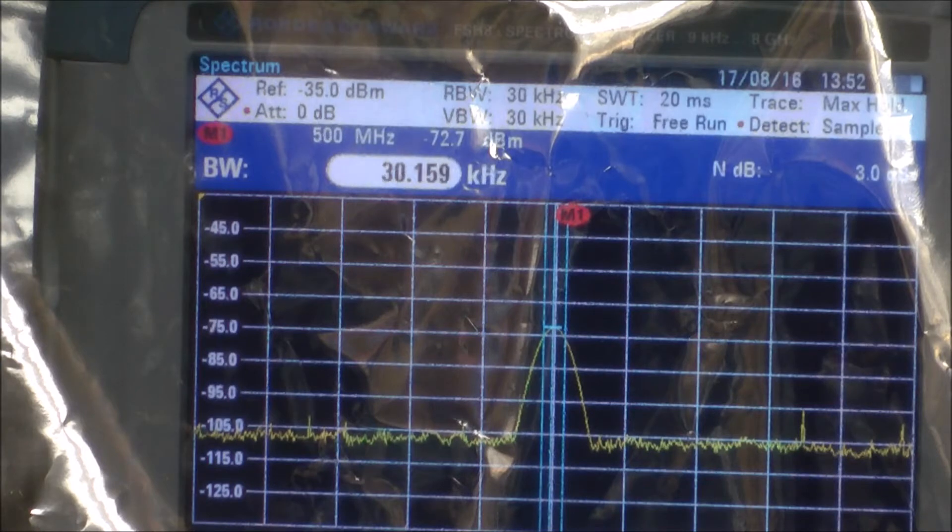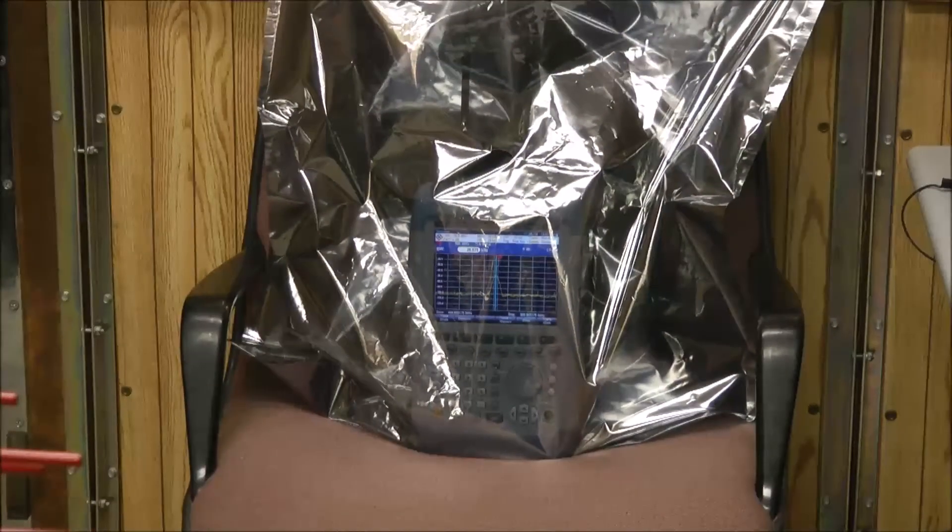So that's not very good. 15 dB is certainly not enough to protect against an EMP. This bag I would classify as a poor Faraday cage — it doesn't provide very good shielding at all. Other bags provide much better shielding, some of them as much as 50 dB across all frequencies from 100 kHz to 1 GHz.